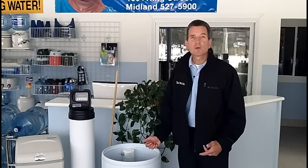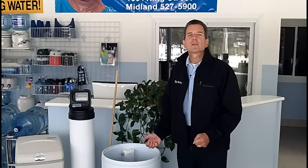So how do you know if you have a salt clog? Well, the most common symptom is that the water softener stops using salt — the brine just isn't being made. The other way people notice is that their water is hard. All of a sudden they're getting staining and hard water problems, because the water softener just isn't softening their water anymore.